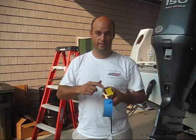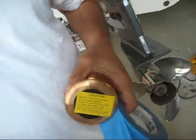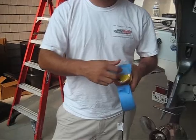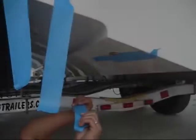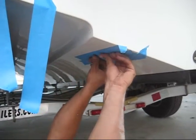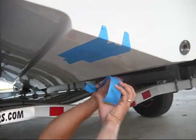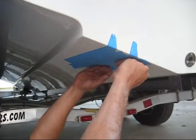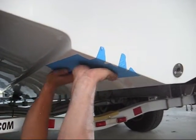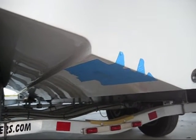Airmar says not to use any acetone or solvents on the bottom of these transducers, so if you get sealant like 4200 on there, how are you going to get it off? What we do is take some blue masking tape and put pieces right across the transducer and around the fiberglass on the boat, then cut along the perimeter so the tape falls out cleanly. We'll take a razor blade and cut a slice right around the perimeter of the transducer, and what will be left is a perfectly masked-off transducer and hull — ready to just put sealant on, the big retaining nut on the back side, and we'll be good to go.